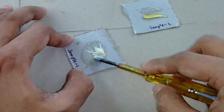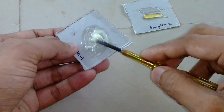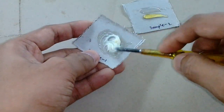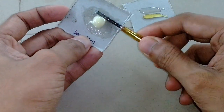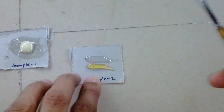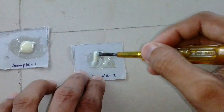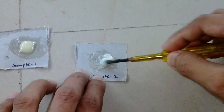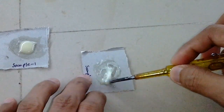With fast-curing epoxy, when you mix it in large quantities it undergoes an exothermic reaction, giving out heat that makes it dry faster. Because of this, it becomes really difficult to work with in large quantities — it's recommended to mix in smaller amounts each time. Here, though, it's a slow-curing epoxy, not fast-curing, so you can mix larger quantities. However, if you apply external heat, it will also cure fast.